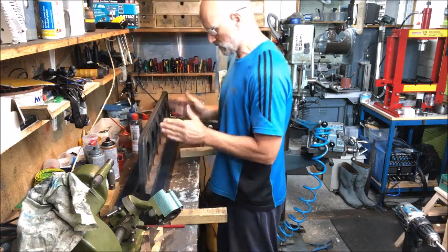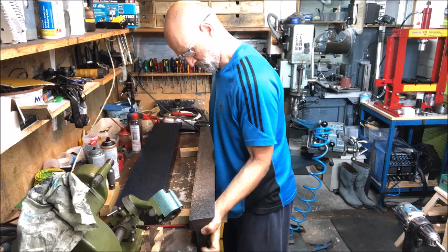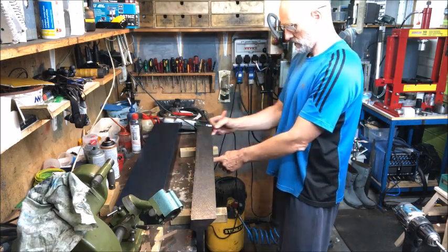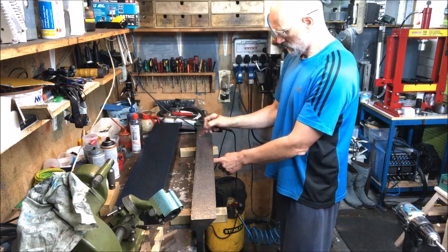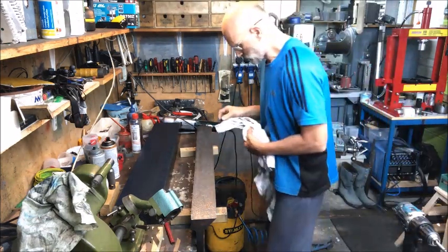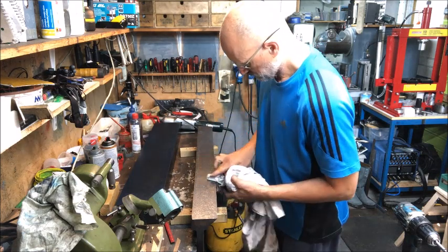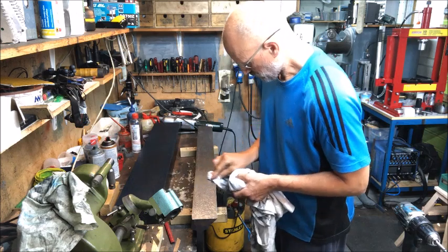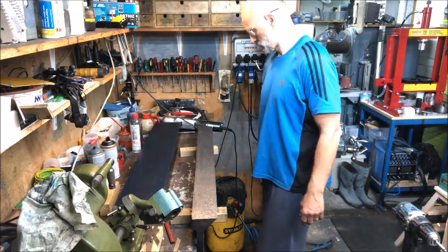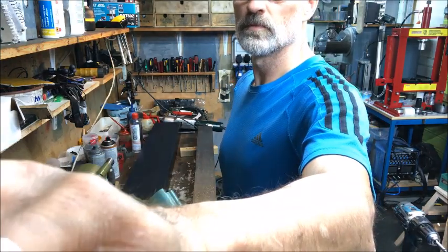You could relieve it — just take that section, don't bother with the rest. This is clear. The way to do that is just to decide where it hinged. Take everything away except that spot where it hinged, so just don't take that. To avoid making any mistakes, do it like this — I want to take the middle part. So that was straight edge scraping.